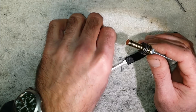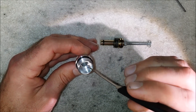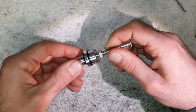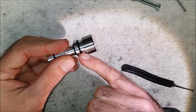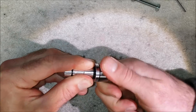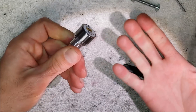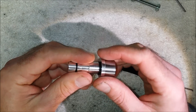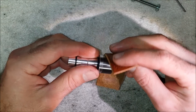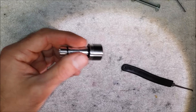This one's not leaking — it's all fine. I only stripped it to show you. So I'll put it back together. The little plastic disc goes in first, and then the piston goes in — it just pops back in. Unscrew the bolt, then screw the cap back on. Make sure the O-ring is in good condition; if it's not, replace it. Tighten it up — it doesn't need to be stupidly tight, basically tighten it until the gap's closed. If there's a gap, there's a chance air may leak out. You should generally be able to do it by hand. If not, you could wrap a little bit of leather around it to protect it and use grips to loosen it, but you shouldn't need grips to tighten it.